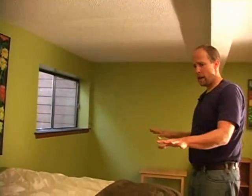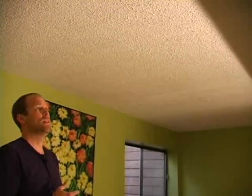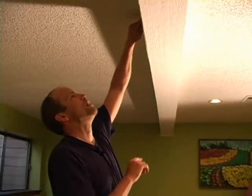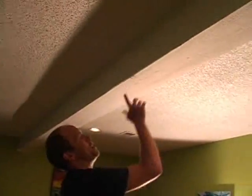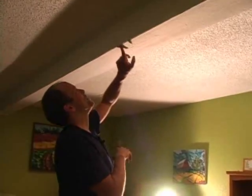So just doing a visual inspection, you have to orient yourself, figure out the key areas where you want to inspect. And then this is the one critical area. It's underneath this deck. And right here, I really don't see anything visually. There aren't any watermarks, any water stains, no water damage. There are some water stains. Correction. There are water stains right here. There's a brown water streak. There's a brown water streak here. There's a watermark here. I'm smiling because I'm trying to do an educational video. During inspection, I don't smile.